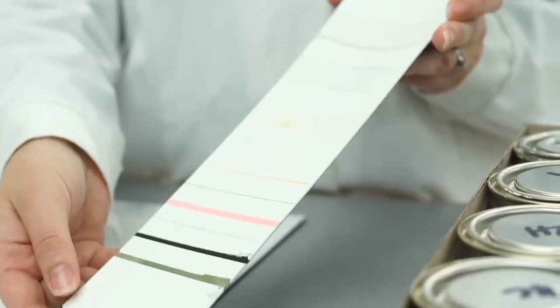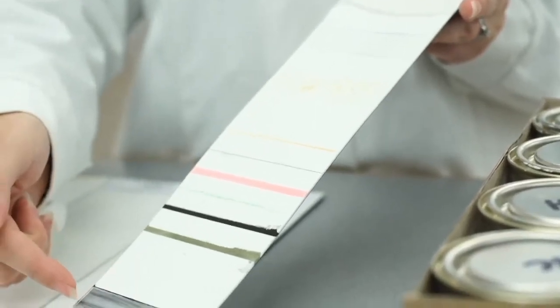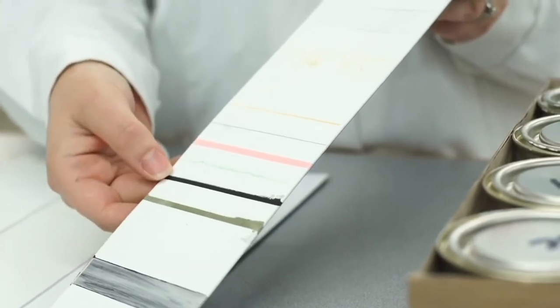When we test for stain resistance, what we do is we apply lots of different stains to the panel, such as red wine, coffee, curry, different pens, pencils, flip chart markers, things like that. And we try and wash those stains away. So the stains are left for a certain amount of time and then washed away with soapy water.